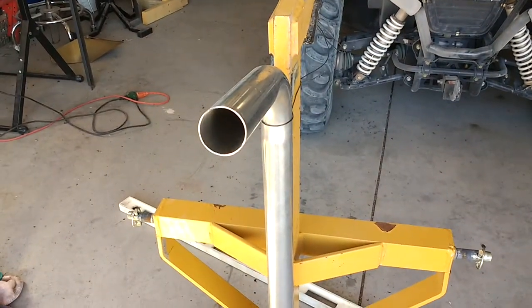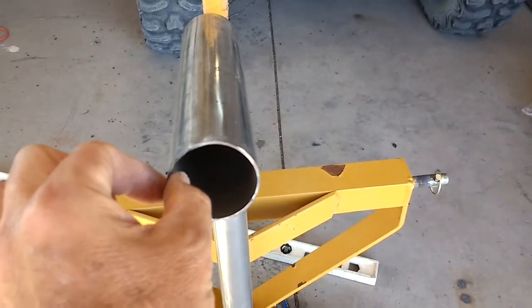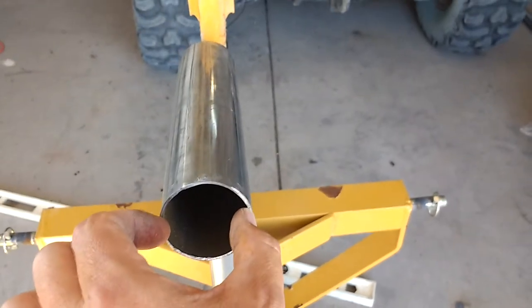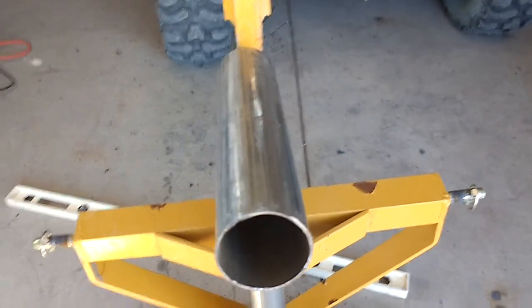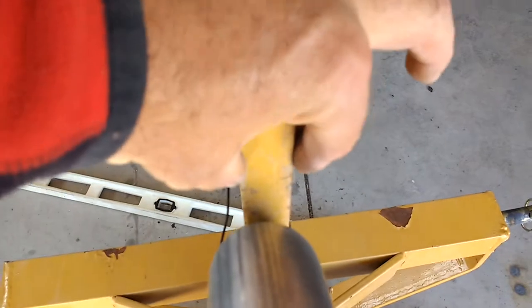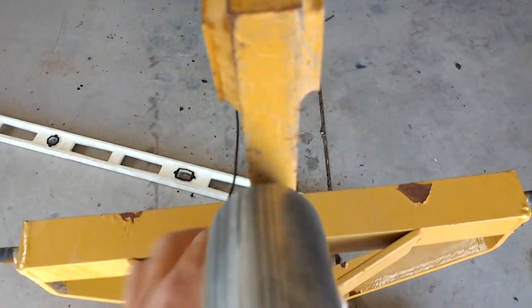I ended up going to an exhaust shop and this is two-inch aluminized steel. I'd probably have gone with the one-and-a-half inch to make it a little bit narrower but it was a lot thinner, so I wanted to be able to weld one-eighth strap onto this. The guy said if you're going to weld one-eighth strap, go ahead and go with the two inch. My only worry is it's a little bit wider than the subsoiler — this is the Tractor Supply subsoiler, I think it's County Line — this is one inch wide, so this pipe is two inches wide on the outside, so it's a half inch wider on each side.